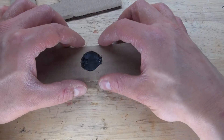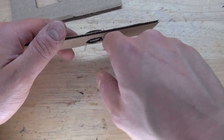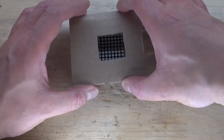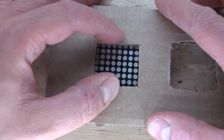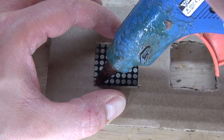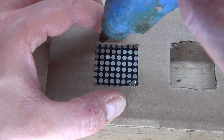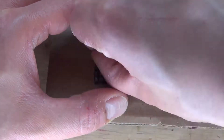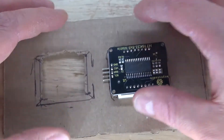Since this is the bottom part of the housing, I need to make sure the 3-volt button cell battery holder is perfectly flush with the cardboard. Simply place it onto the workbench and press it down — this allows it to be perfectly flush with the bottom of the housing. Now it's time to connect the 8x8 LED Matrix to the cardboard. Take a very small amount of hot glue and place it on the corners of the LED Matrix — just enough to make it stick without being visible.